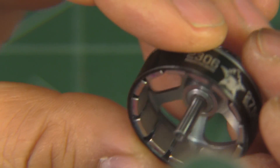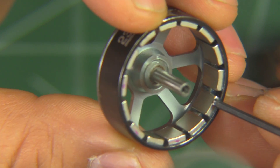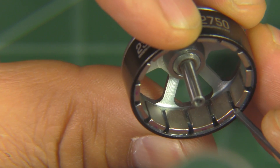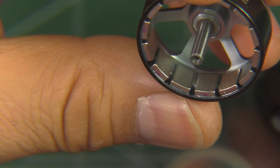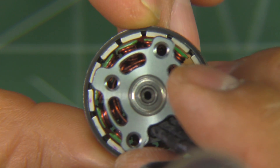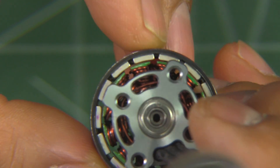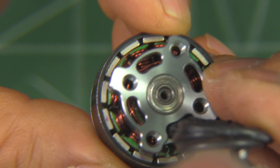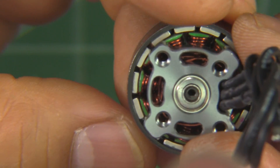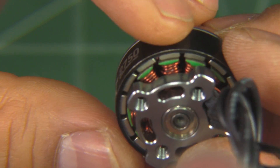Here's the bell. The magnets look pretty good — there's plenty of adhesive around them. They are curved magnets with pretty good density; there's not a lot of gap between magnets. As for the air gap, it looks pretty good — not extremely tight and not loose either, I think it's just right. You don't want it too tight because apparently that can sometimes cause yaw glitches, where you get too much feedback back to the ESC when you have strong magnets and a very close air gap.